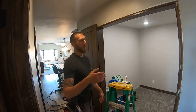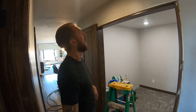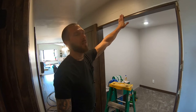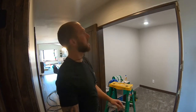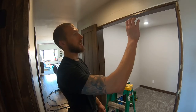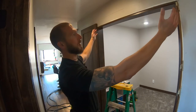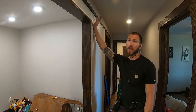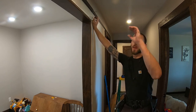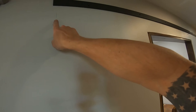I'm opening the door on the left side and making a reference mark on the wall, then doing it on the right — that way I know the bare minimum track I need to open the door. I also marked a center line for reference. I locate my studs and play with the flat bar track to see where it works best — hitting my header in the opening, then going far enough out to hit studs. Most barn door hardware has 16-on-center holes for the legs.